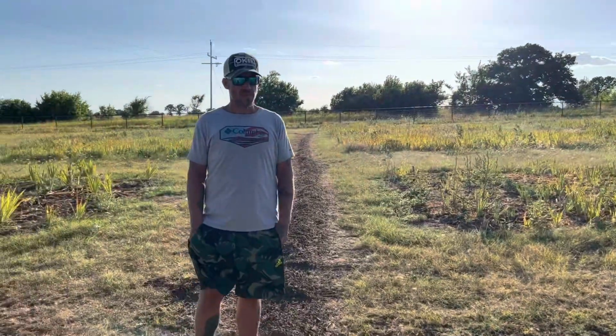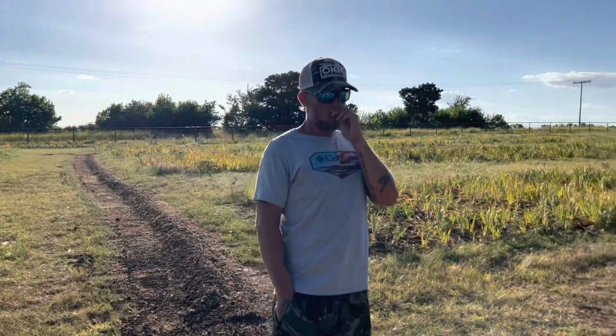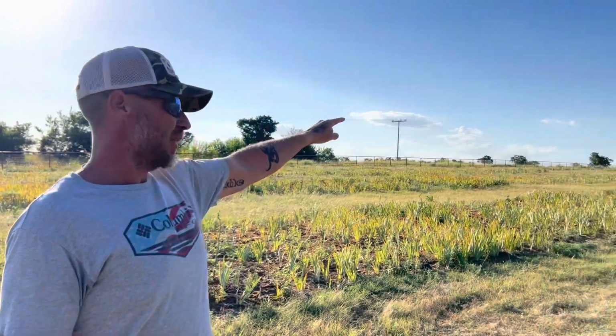So how much water line are you going to have to use, and where are you going to have to start, William? Basically, it's 1,603 feet of 1-inch water line, and then my last 150 feet will be 3/4. It's all going to be PEX, and then I'll use frost-free faucets, put in 7, and basically it starts way up there and ends way over there.